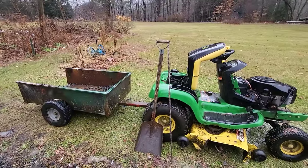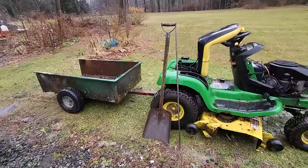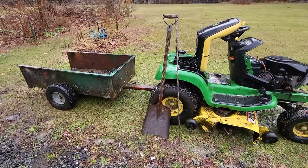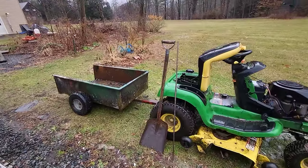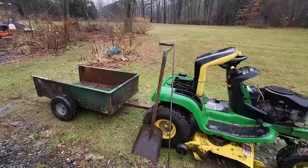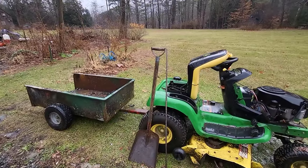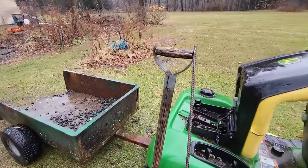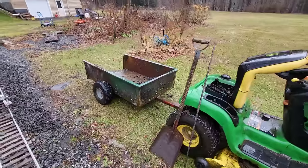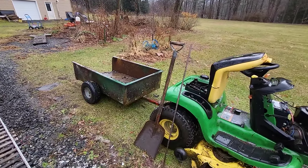It might just be a really cool shovel for shoveling ballast, but I've repaired it. It had a split pan on it, or a split scoop. I welded it together. I've got another one that's nearly identical that's all bent up. I'm going to blacksmith that back into shape and weld the cracks in it and probably repair the handle. These are fantastic shovels. Also, if anybody knows what kind of wood the handle would have been made of, I want to replace the handle on both of them. So, that's a quick request from my steam engine friends.